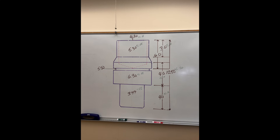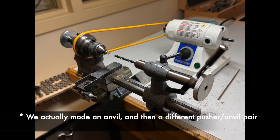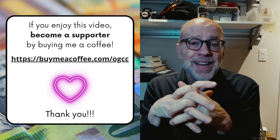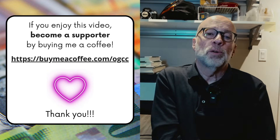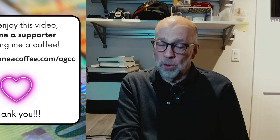Then we made a brass Horia anvil and pusher. We learned to use the tailstock on the lathe for drilling. Instead of the drill bit moving, the drill bit is stationary and you push the stationary drill bit into the piece, which is rotating. It's the same as drilling, but sort of backwards. Setting it up was surprisingly complicated. The end result was good, but I needed to kill a few prototypes — more than I think I should have — before I succeeded.